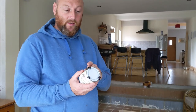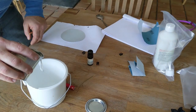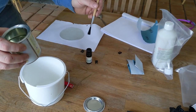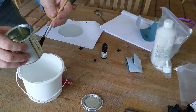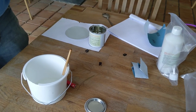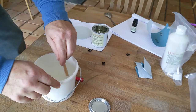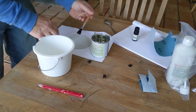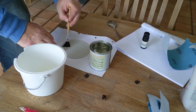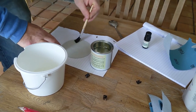When mixing the glue, I'm not going to tell you the exact ratios because they're all different — just follow the instructions on your glue. The first thing to do is mix some of the glue. You don't pour the hardener into the main glue pot because then all of your glue will go off. Mix it in a pot separately so you're only mixing up the amount you need. Then apply some to the back of the patch and let this start to harden for a while because you want it to be tacky, and then apply some to the boat.